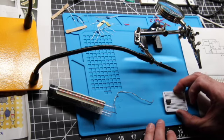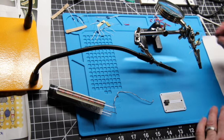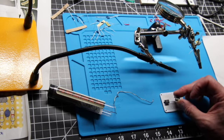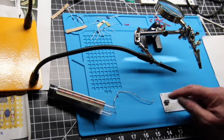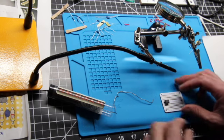Also, I'm not going to use this little guy for this project. This is a very simple, quick solder job. If something goes wrong with the chip, it's easy to replicate this. Normally I would, but for this project, I'm going to try to keep a low profile since we're crossing those jumper wires on top, and just use the chip itself.